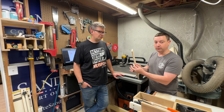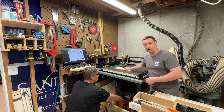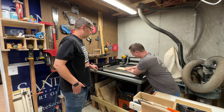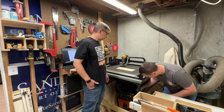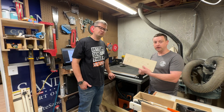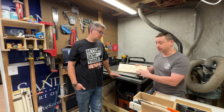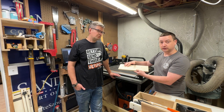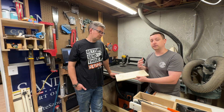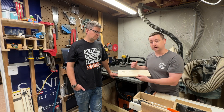Just a standard piece of plywood. You can see the 28 by 28 open table — we can move the part all around. We turn on the vacuum and we are able to successfully hold this part. Now with text like this, I want to point out there are limitations to the system. When you're doing profile cuts in small text or letters, there obviously are going to be limitations. The system will not be able to hold that — even my four by eight system using a black box hurricane would not be able to hold this text.